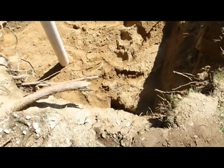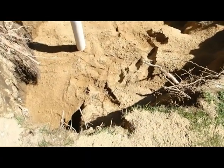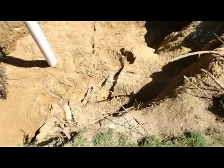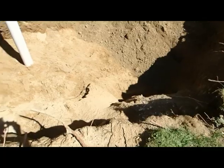We've covered the filter fabric — the geotextile, it's actually road fabric in this case — with a layer of coarse sand and a layer of fine sand to protect it. Now the original material is going back in the hole.